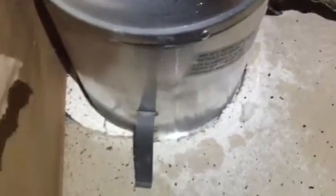So this right here is the can light. It's popped in — that's how they insulated over it. They just kind of laid the batt over it. You can see there's a big gap and there's no insulation. So we're going to pull all that out. Right down along the outside you can see that's the hole cut in the drywall — that's where you're getting a lot of air leakage. So we'll be building boxes, foaming them in, and air sealing them. This is the insulated and air sealed box that we build around our can lights. It's a two-inch foam board which acts as insulation, and we'll also blow insulation over the top of this as well. And can foam, sometimes tape and caulk, to seal all the seams. And that's the fix for can lights in your attic.